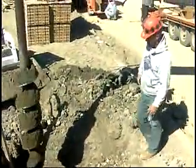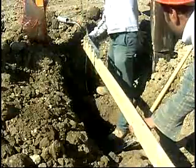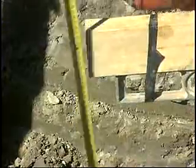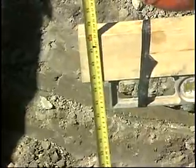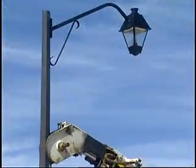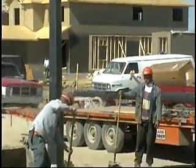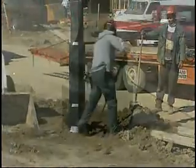Because of the ornamental flared base on Americana poles, it becomes essential that the hole is augered to the correct depth to ensure the appearance of the pole is not compromised. The depth of the hole can be adjusted by using more or less gravel in the bottom. If the pole is set in an area that will be paved, ensure that it's a couple of inches higher than grade to accommodate the height of the paving material.